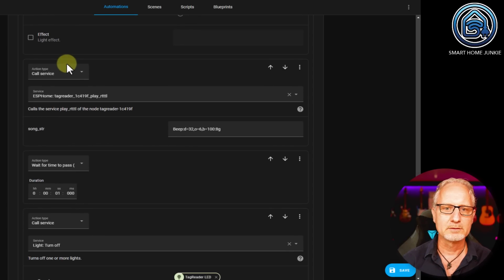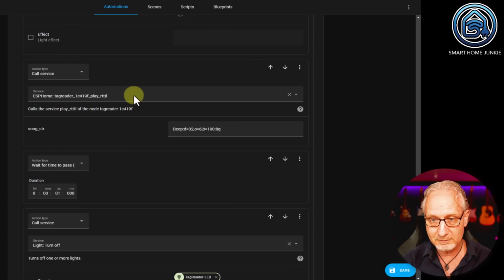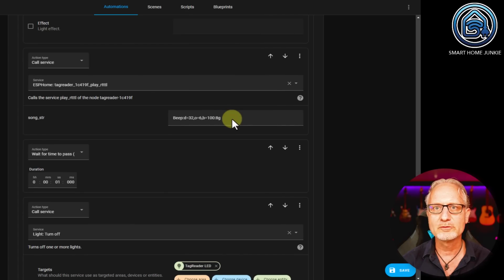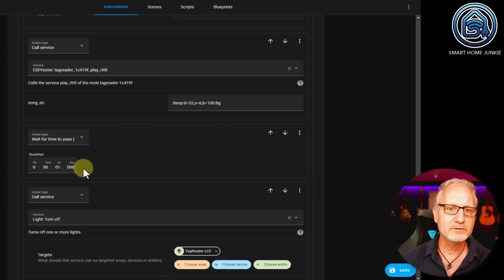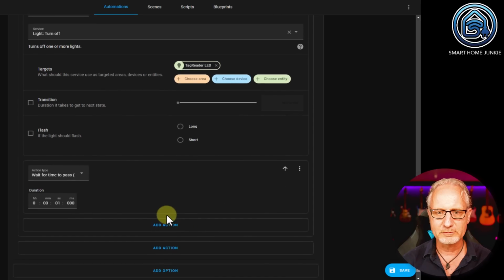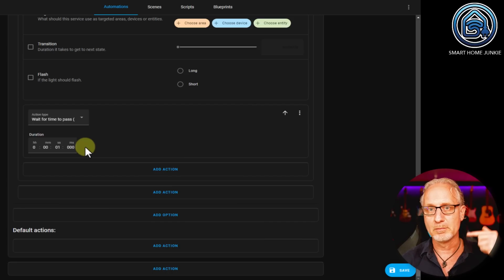then call the service ESPHome tag reader play RTTTL, which is playing a sound, and then you have a song string that you have to send. I'm not going to dive too deep into those song strings, you can look it up yourself. Then wait 1 second, then turn off the LED, wait for time to pass and wait 1 second again. And because of the fact that this is a repeat, it will blink every second until the state is armed away.